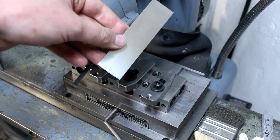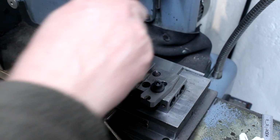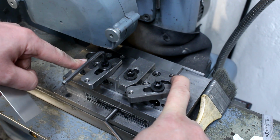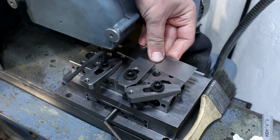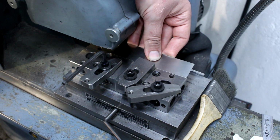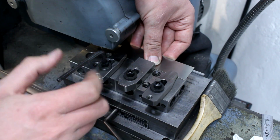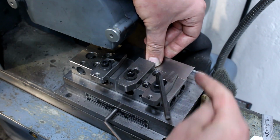So next best, abrasive cutoff. I set off a pair of 1-2-3 blocks on my magnet chuck. I have a strap clamp here. That's basically the fence where I'm pushing my stop up against. And I have two strap clamps that I can move to hold the stock down.